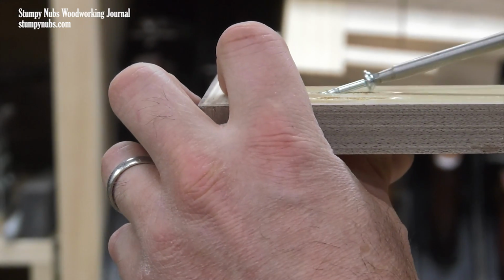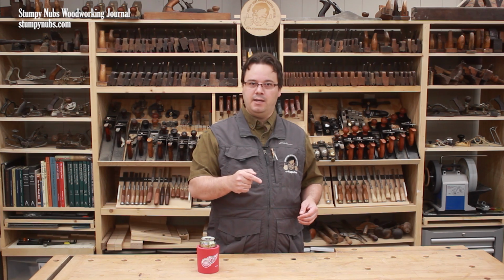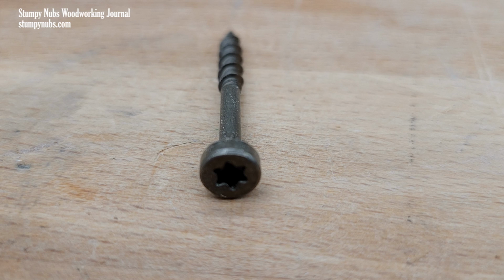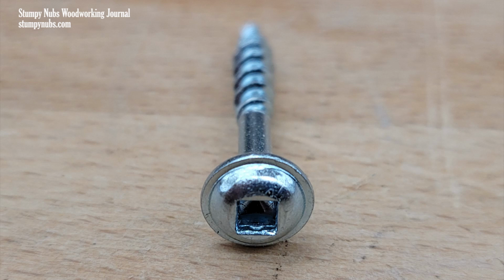It may depend on how you load your screws. If you typically slip the screw into the pocket and then place the bit on the screw, then you may find a Torx head best because it's least likely to slip even if the driver is not perfectly aligned. On the other hand, if you like to preload the screw onto the driver and then insert it into the pocket, you may find a square head stays on the tool better as you're putting it in.